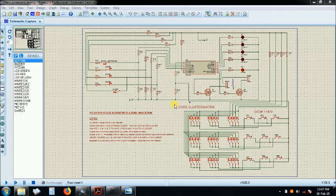Hello, welcome again. This is my second project number 18 — a house alarm using PIC16F819. It can show four zones: zone one being the entrance zone, the main entrance door, which behaves differently from the other three. It also has an indication for short circuit on the zones — if any zone is shorted, it shows you which zone has the short circuit.